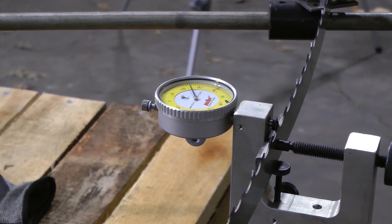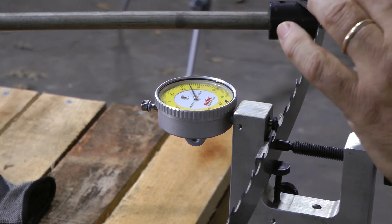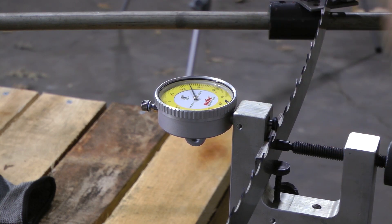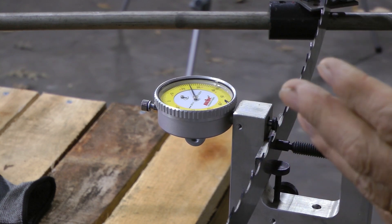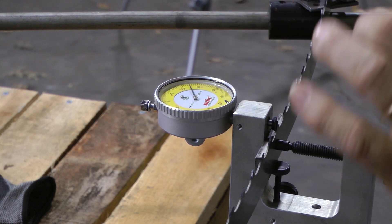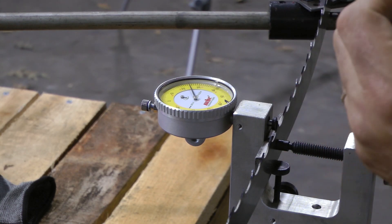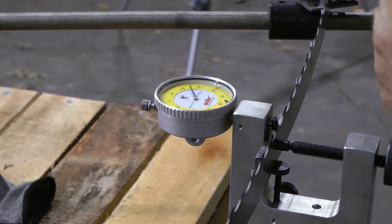When I come up and get on that set, we're at 24 and a half, 25, 27, 28 thousandths. I like to be a little wider on my set — a little more set than too low. Our experience is 15 thousandths is just too low; you cannot cut enough kerf to let the blade come through. 20 thousandths will work if you want a narrow kerf in cold weather, to drag the sawdust out a little bit better. But the most forgiving blade, if you're sharpening and running things yourself, is to go 26, 27, 28, even 30 — it doesn't hurt. We're going to set some at 40 and just see what it does, try to look at how much sawdust we leave behind.